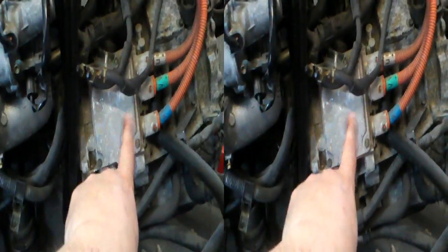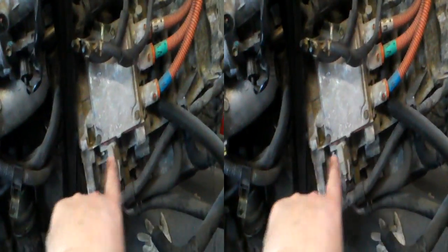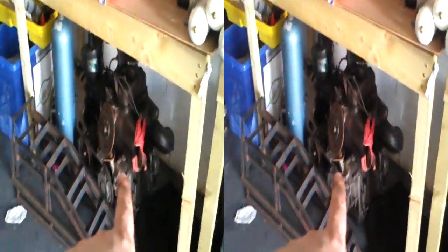So that bit there is going to get attached to — walk down here and you can see it — that. That's going to get attached to that so that we can make around about a 5 to 10 kilowatt generator. A 650cc engine, which is perfectly adequate to power it. Because it's a 23 kilowatt engine, so there's plenty of power for around about the 10 kilowatt mark.